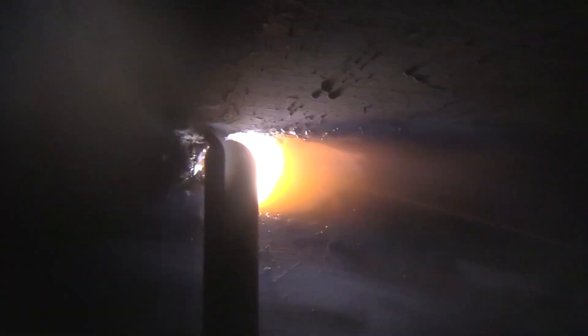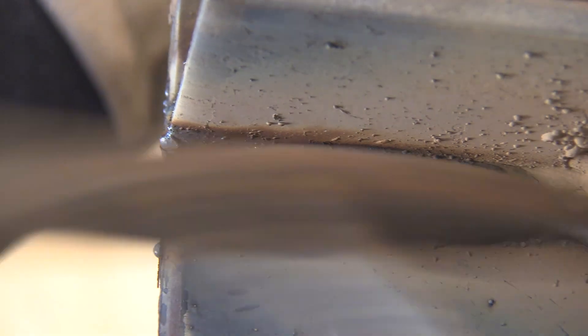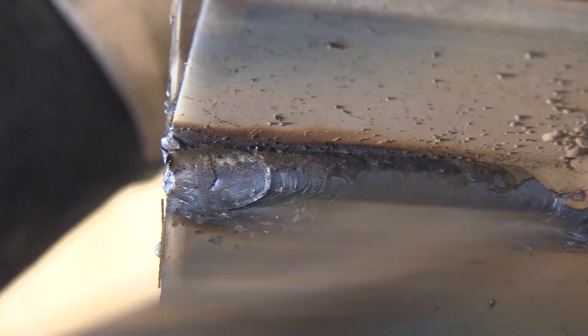This is the last half of the weld here. I'm not using much rod angle because toward the end of the rod, even at 125 amps, you can set up a little something called arc blow, and you really have to hold a tight arc. I've found that holding a straight-in angle instead of rod angle kind of helps prevent undercut toward the end of a weld like this.